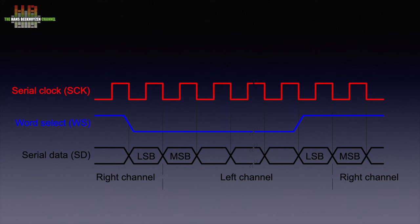Before that, three or four BNC cables and Cat5 network cables were used. The problem is that neither the use of HDMI or Cat5 is standardized, so what signal travels over what pairs of cores can vary. The most used pinout is the one that PS Audio uses, but other pinouts can be set in the setup menu on the Arce. Again, the instructions in the manual and in the Vinshine YouTube video are clear. Links in the description.